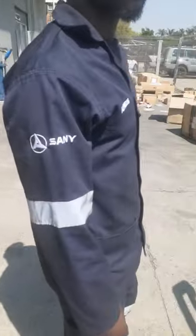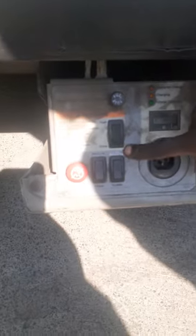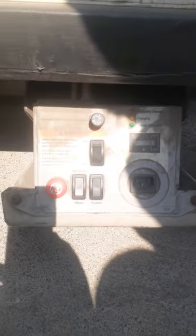Firstly, I will check my remote control box and see whether the machine is on drive or on push. This is our drive, this is our push, this is our platform, and this is our base. This release works when the machine is stuck — you put it on base and release. The push mode is used when the machine is off or out of battery — you select push, select base, and then push the machine.